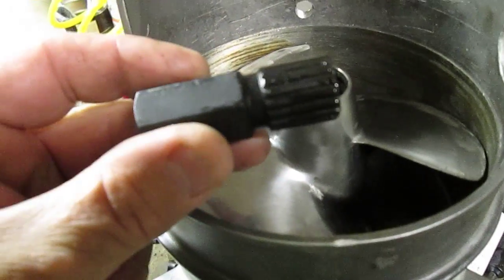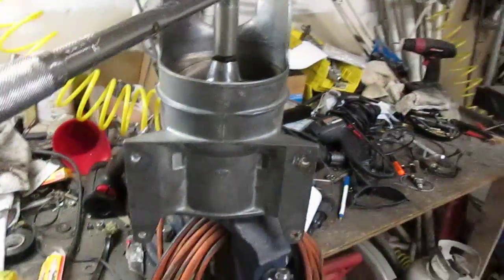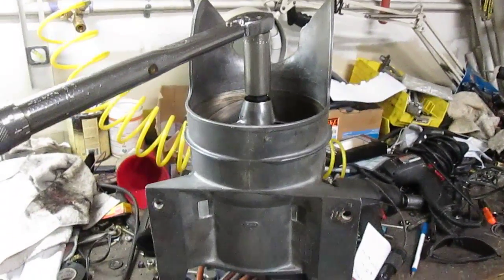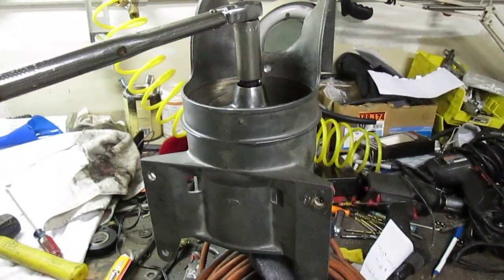This is a special tool I have here — I bought it on eBay for about eight dollars. It goes in here, and I have it on the vise on the bottom holding the bottom shaft bolt. Now I can torque it with my torque wrench to 72 foot pounds, and then this thing's ready to go back in. It's really important that you torque these things down, because they do come loose and you will damage your wear ring and your brand new impeller. I've seen it done twice now, so torque it down. Hope this helped.